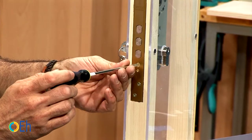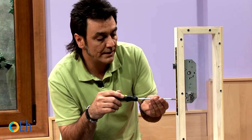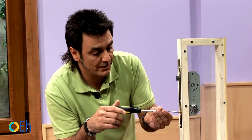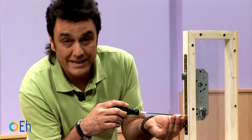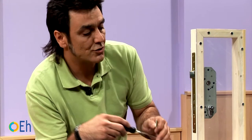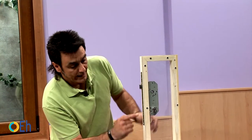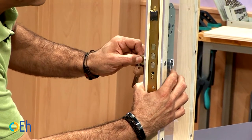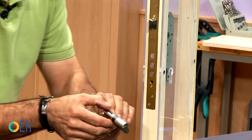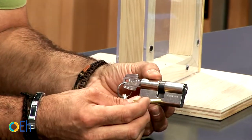Let's remove it. You'll see how simple it is to extract the cylinder. This type of cylinder locks are usually called euro profile cylinders. Whenever you have a cylinder with this shape, the measure is the same in terms of its outline, though there will be variations in width measurements for the different door widths on the market. We have removed the screw and now we push the cylinder and pull it out. If you look at the cylinder, it has a central cam, and the screw goes through this thread here.